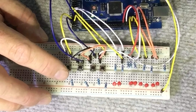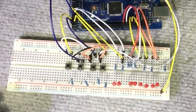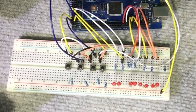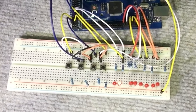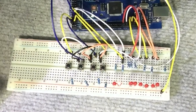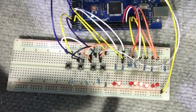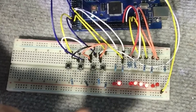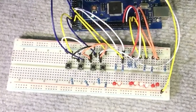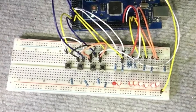I'll press the bank button and you'll notice we get an LED on. I'll press the bank button again — the second bank LED is a bit dull for some reason, even though it has the same resistor value; I'll sort that out later. So we'll go back to the brighter bank. If I press the first patch button, you get a certain sequence of those six LEDs. I can easily make this an eight-loop program — I've only got to add another two lines per patch. Press the second button, we get another sequence. Press the third button, we get all of them on — just another sequence I can program however I like.